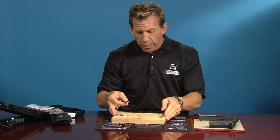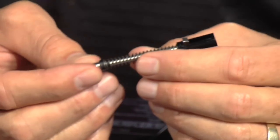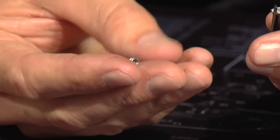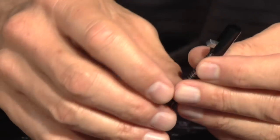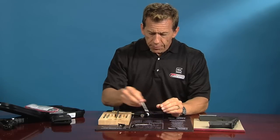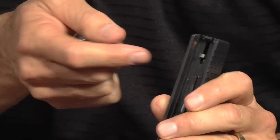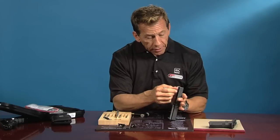We have an extended striker assembled with a higher power spring, captured the same way with the spring cups and spacer sleeve. There's also the little rebound spring — a tiny little spring — and we created this to make sure we get the rebound effect on this striker. I'm going to drop this rebound spring right into the spacer sleeve so it's sitting upright. Then we'll go address our slide. I'm going to pull the slide cover plate off by pulling the striker up a little bit to get access to the spacer sleeve inside, then depress the striker spring with the spacer sleeve to take the pressure off the slide cover plate, and push the slide cover plate off.